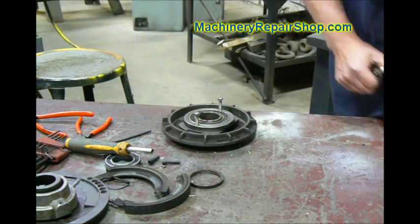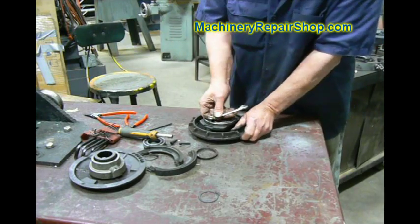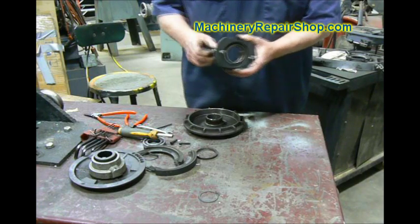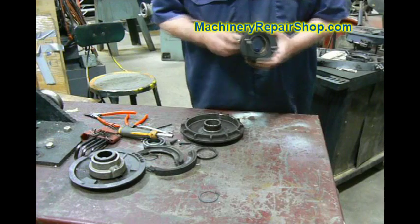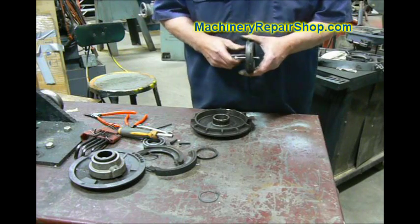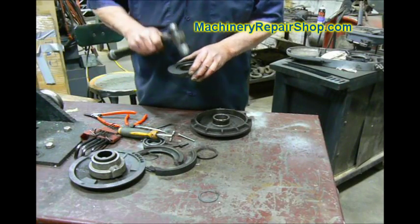We are making progress. Five minutes later, we've got this assembly out. You can see the surface it's pressed onto. I've actually seen these where the bearing has worn it so much that it's no longer a press fit, which means it needs a new pulley. This one is actually pressed in there but not too hard. If you're particular, you can go back to the press and push it out, or most of the time simply placing the bearing works.